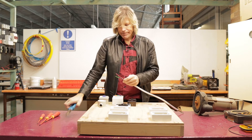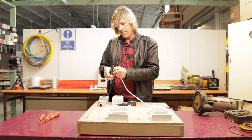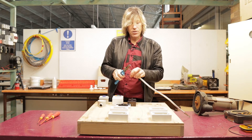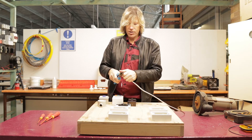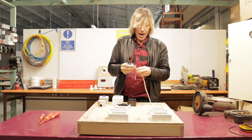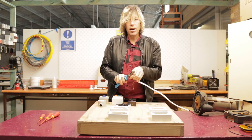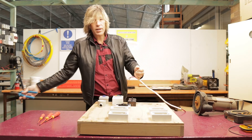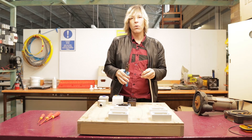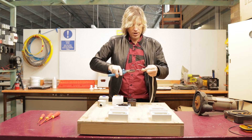You need to strip your cable. If you have not watched the video on how to strip and terminate cable, please do so. Now, if you have watched that video, you are probably noticing that I am actually doing something incorrect — the way I am holding my pliers. I am touching the conductive part of the pliers. That is actually a bad habit I picked up when I was an apprentice, because a lot of times as an apprentice you are not working on live equipment. When I do work on live equipment, I am super careful and always watching what I am doing. It is a good idea not to get into bad habits, so follow the way I do it in that other video and you will always be safe.